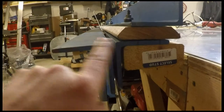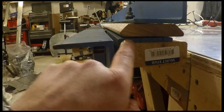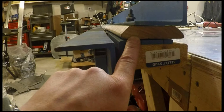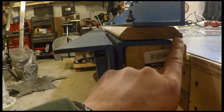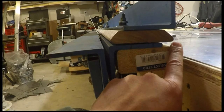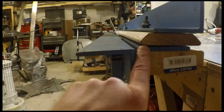This is the bending arm here. This is the bed or rest or clamping surface. And then I've got a 1x4 piece of solid oak. It's a red oak trim that I've mitered and put a radius in on each side. So on this side back here, this is the 1/8-inch radius that you use for most of your build. And then this front nose here currently is a 1/4-inch radius that I put in.